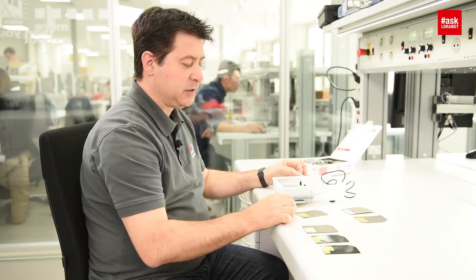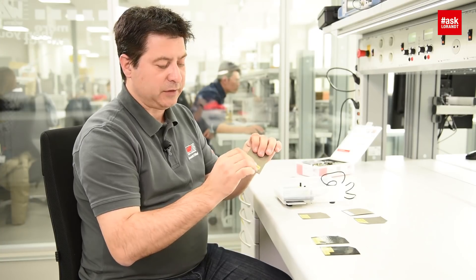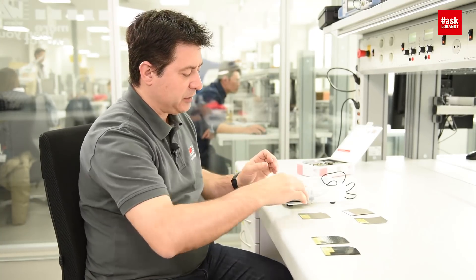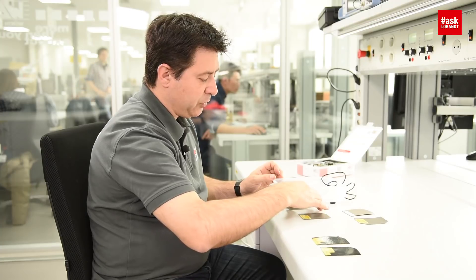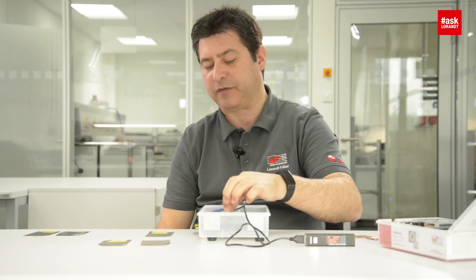To increase the distance and be very reliable, I would recommend to use at least 1 mm thickness. The 1 mm thickness is quite flexible as well. It's the same material, but much more stable, and then you have better decoupling and better read distance for the RFID tag.